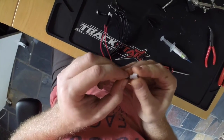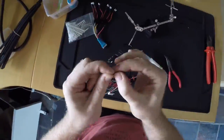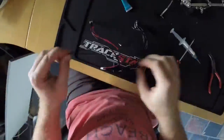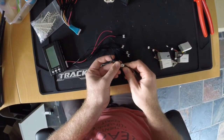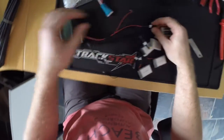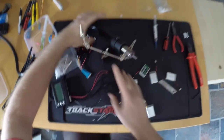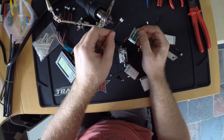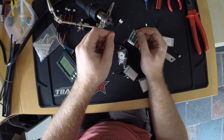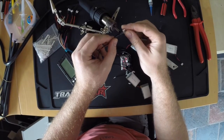That takes a bit of time so I'll speed that up. Done. Before I finish them up with the heat shrink, I test them by just plugging in six batteries. If they show up correctly on the screen, that means the connection is there and correctly polarized. If not, I'd rather check before gluing them together. Now that looks all good, so just hit them with 300 degrees and done.